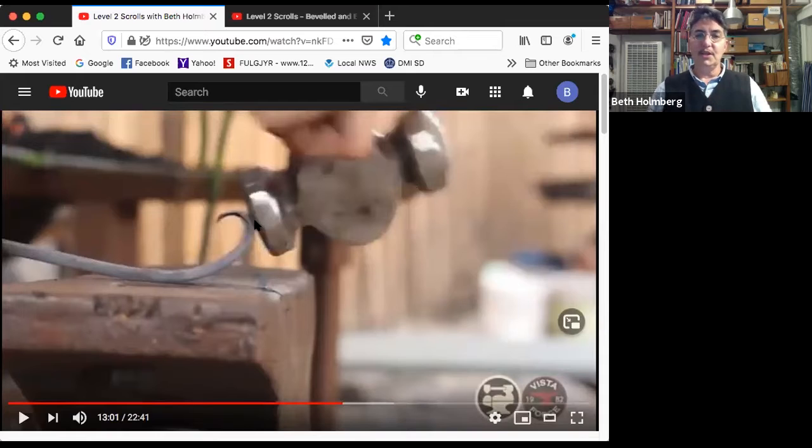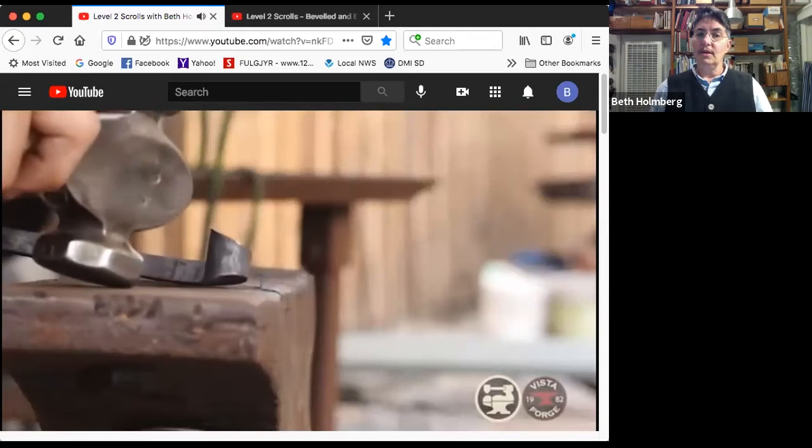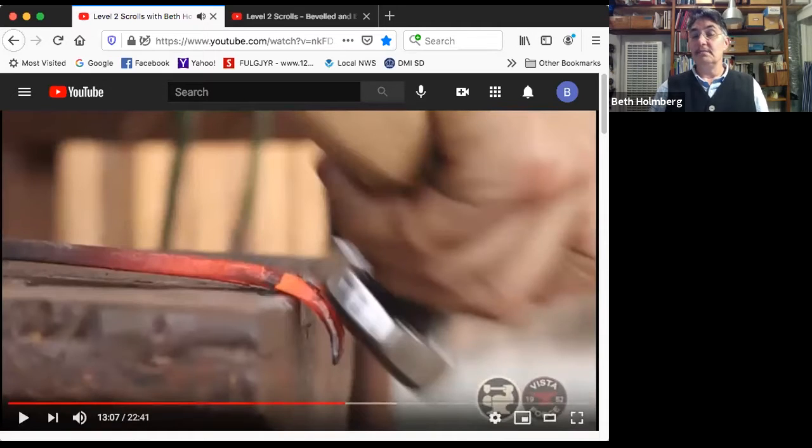Right now, in this position, hammer is here, anvil's touching here. That's going to make it bend right in between the two of them, right there where it's a little too straight. So looking, figuring out where I need to hit it. That looks pretty good in the center, at least. Not scrolled enough, but the center looks good. Reminder, when you're scrolling over the edge, that hammer's at an angle and it's hammering over air.